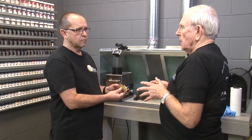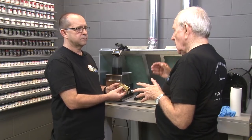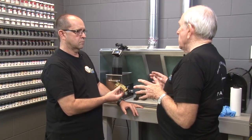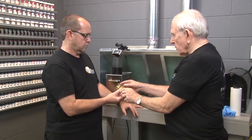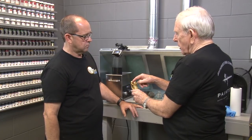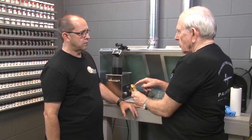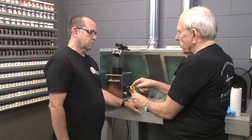Aluminum oxide, 300 grit or smaller. When I say smaller, the number goes up. Right. Aluminum oxide removes the base metal. I don't recommend removing paint, especially if it's really on. If you're blasting this with aluminum oxide, and the paint doesn't start coming off in one spot for some reason, as you keep blasting, it's removing brass. So finally, when you get it off and you put your first coat of paint on, you'll see where that blotch of paint was.